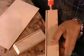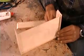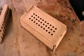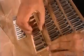Now he builds the wind chest, the box that houses the steel reeds that produce the accordion's sound. Moving the bellows in and out forces air through holes in the wind chest. The buttons you push determine which reeds get this air, producing notes. The longer and thicker the reed, the slower it vibrates and the lower the pitch of the note. The shorter and thinner the reed, the faster the vibration and the higher the note. There are 8 reeds per button. Pushing the bellows in activates 4, pulling the bellows out the other 4.